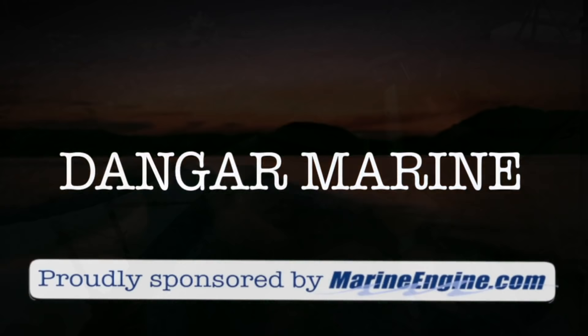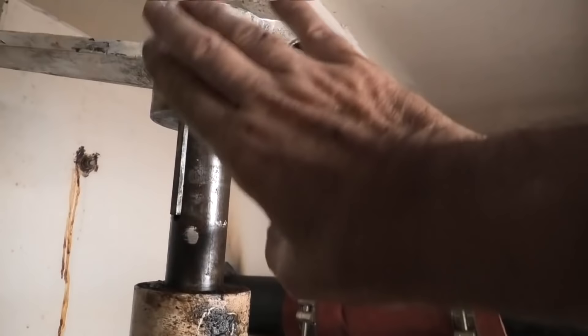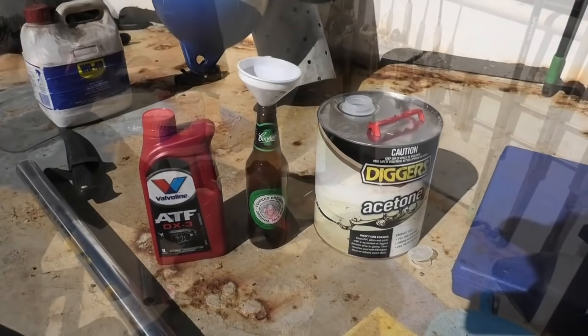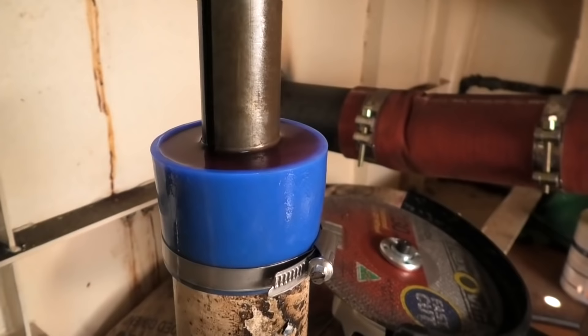Last week we looked at how stuck this rudder post is. Now, at an absolute minimum I'm going to be replacing the rudder post — maybe even the whole tube, as a few people suggest to just cut it out and start again. But before I go to that extreme, I'm going to cut this rudder post lower, which will allow me to get the yoke off, which will then allow me to put a collar around here and get our ATF and acetone mix in here. Sleeve on, hose clamp tight around it, and plenty of space here now to fill with oil, acetone and let it gravity-feed down. Time to mix up the ATF, and acetone, then we'll pour it into that sleeve. I'm just going to let that sit for a day or two.